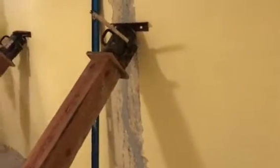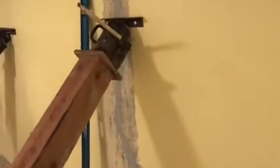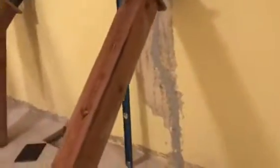We're back out here in Raytown. We are moments away from beginning straightening this half of the front foundation wall. As you can see, we have our interior set up in place. The 6x6s, 30-ton bottle jacks, angle iron. That is what we're going to use to straighten the wall.